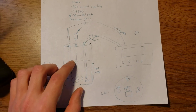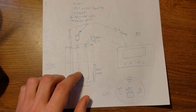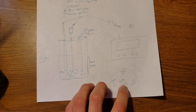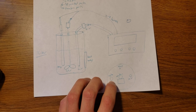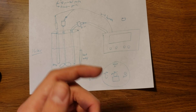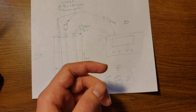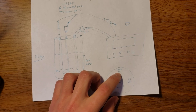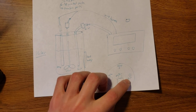I'm going to go over the design of the autoclavable part of the bioreactor. Here's what the lid will look like. We'll need a motor adapter to hold the brushless DC motor, and then we're going to want a septum — a septum is a self-healing port where you can inject nutrients or something to induce the cells inside, or you can take samples from the bioreactor. We'll also need a temperature sensor port and a port for the air.